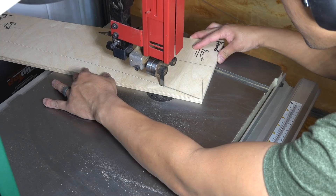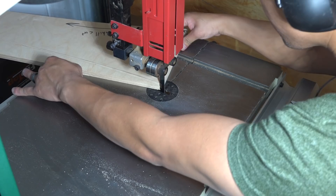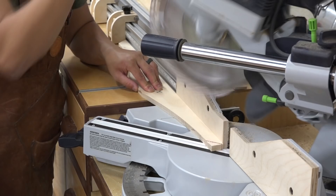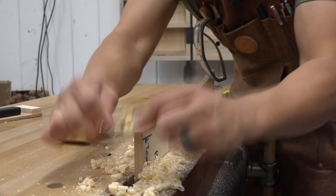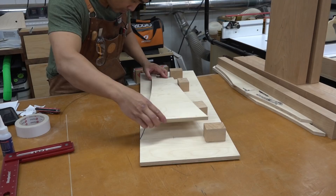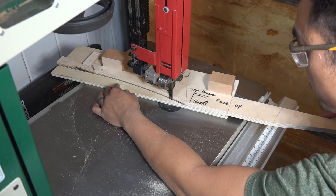Using a drawing bow, I sketched out the shapes in full scale on half-inch plywood, roughed them out on the bandsaw, and cut a 45-degree angle at the ends of the plywood templates at the miter saw. At the bench, I smoothed everything out with a curved-bottom spokeshave. From the templates, I made a pattern routing jig by attaching clamping blocks to another piece of plywood, then double-stick taped the templates to the jig form. The shape is roughed out on the bandsaw and then flush trimmed at the router table.